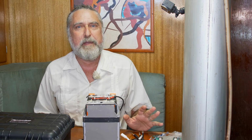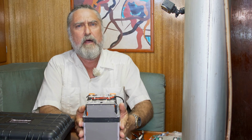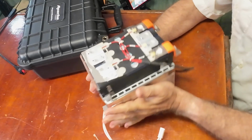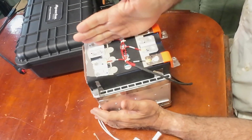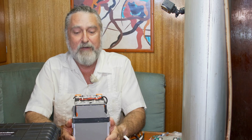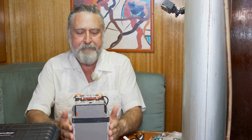So here's what we're gonna need to do this build. This would be the same for any battery build you did. This video is about a relatively small 100 amp hour set of batteries. If you're gonna make like a 400 amp hour build for your system, it's all the same, just things are bigger. Okay, the heart of it is this, so I'll talk about this first. This is a 100 amp hour battery set. There's 4 cells, 4 100 amp hour cells. They're put in series, so that gives us the 12 nominal volts. Your normal lithium iron phosphate setup for 12 volts. You can do all this with higher voltages, just having more cells in series, and you get a little different BMS. We'll get to that in a minute.